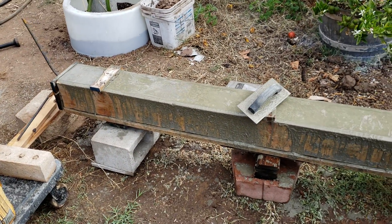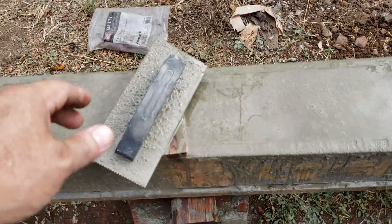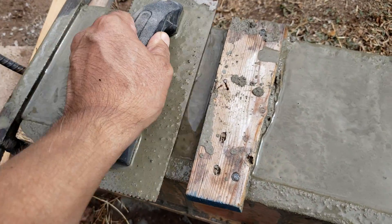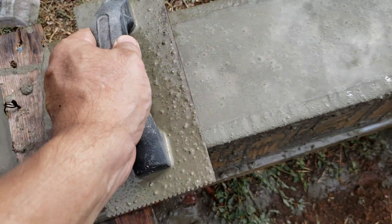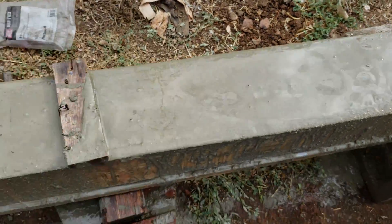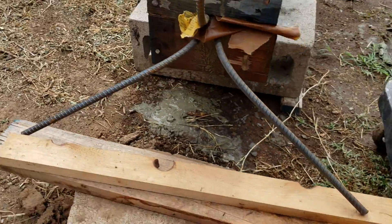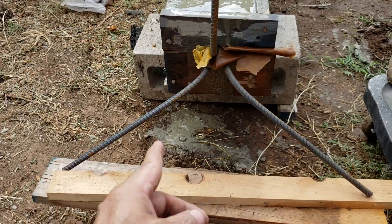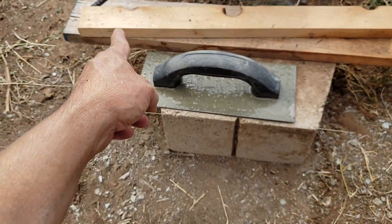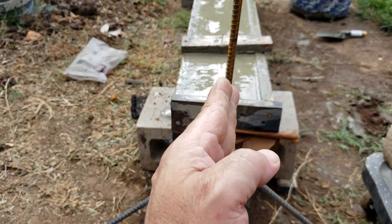This is Suckboy Mahalo here with another video. I just finished pouring concrete as you can see. Make sure that once you pour the concrete your rebar legs are equally spaced — sometimes if you don't tie it well, the rebar has a tendency to move. I have it supported on this side and this one is pretty much straight up and down, held up by the ties.